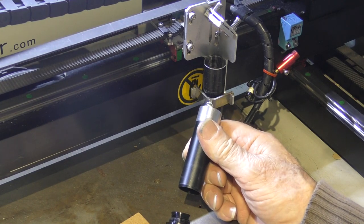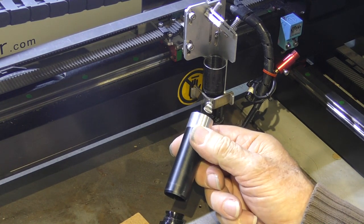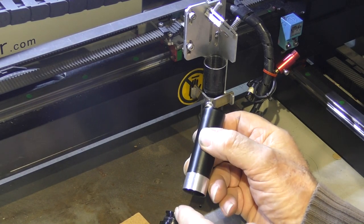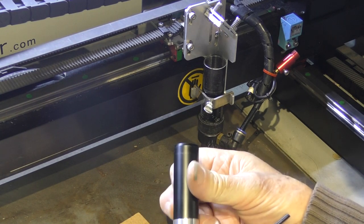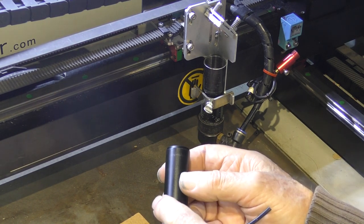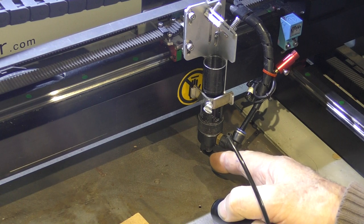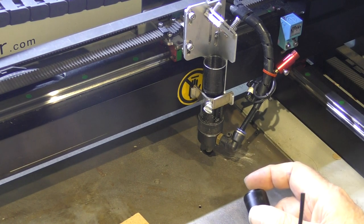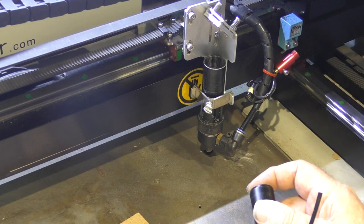if we do that, what we have got in here is a 2 inch lens tube. So we've got a lens tube there which will take a 2 inch, 2.5, 4 inch. It will also take a 1.5 inch lens, and we can also put the compound lens in there as well. And because this is an engraving lens here, we can have a 1.5, 2, 2.5, and 4 inch lens for engraving, as well as a 4, a 2, a 2.5, or a 1.5 inch for cutting. The choice is yours. So you can now do anything from brain surgery down to chopping down forests with this